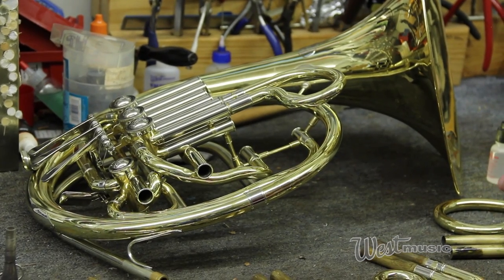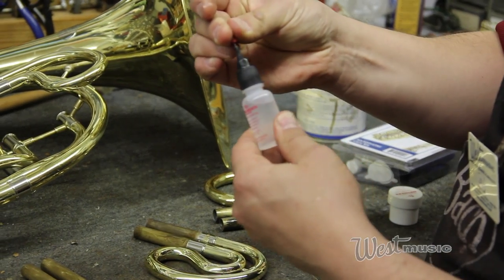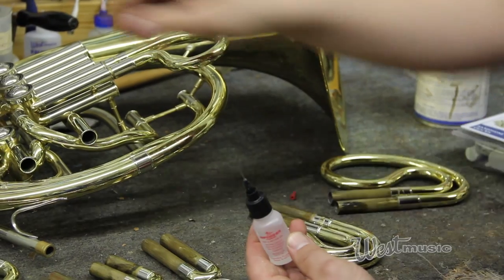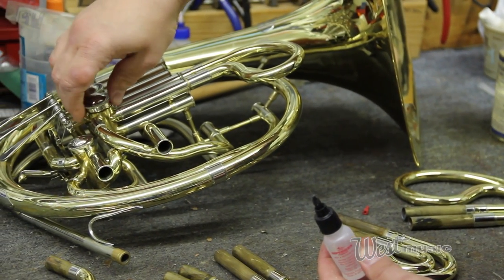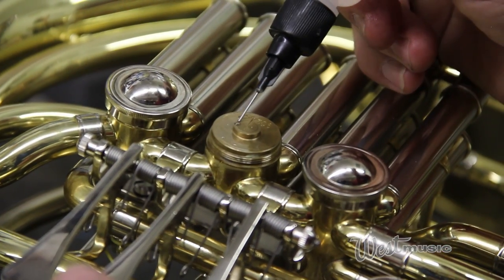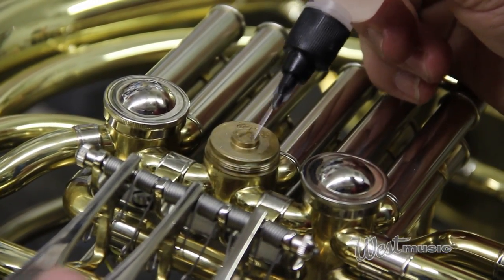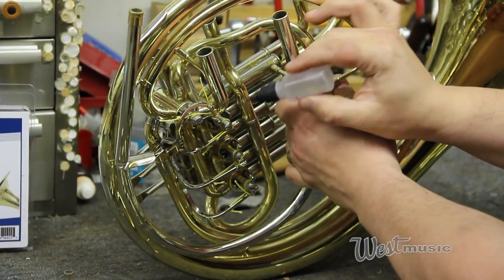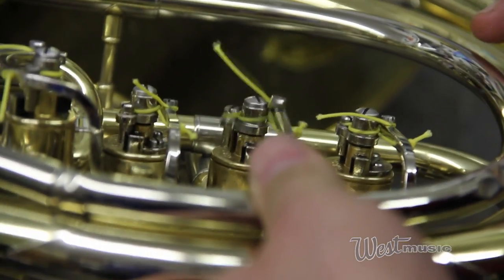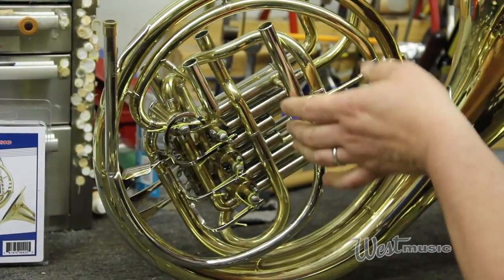The oil here is an important factor for the rotors. This is the spindle oil, and what you'll do is take the little tip off so you have your needle oiler prepped. Remove your cap and just put a couple of drops of oil on the moving section of the rotor, and on the other side behind the stop arm. There's a little area there that's kind of difficult to get to, but that's what the needle oiler is for — you can put a little drop of oil there to keep those rotors running fine.